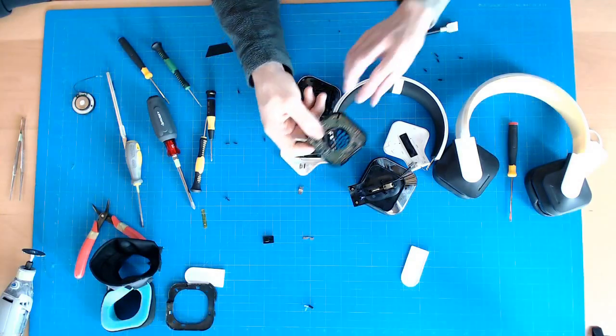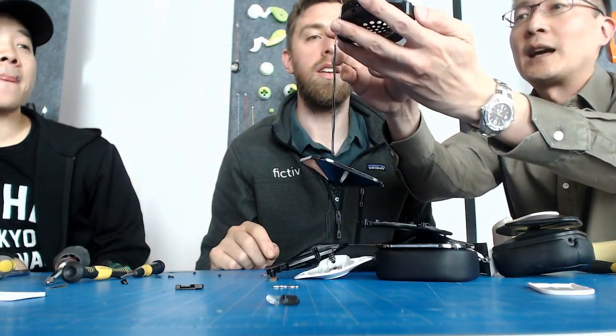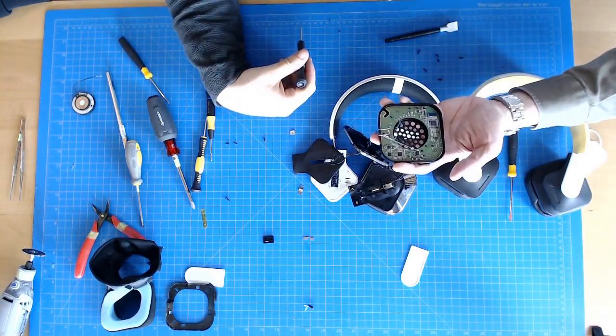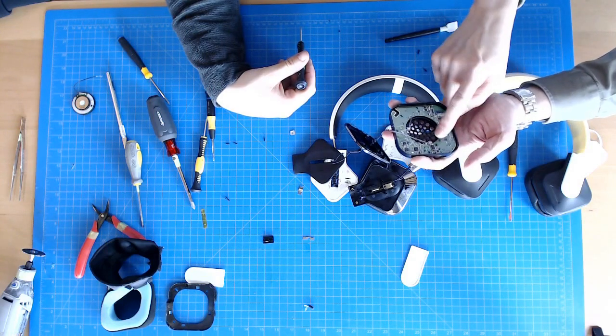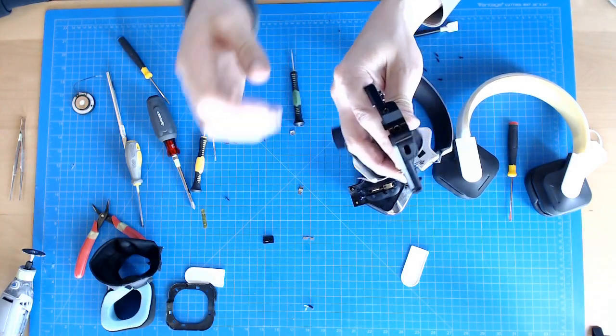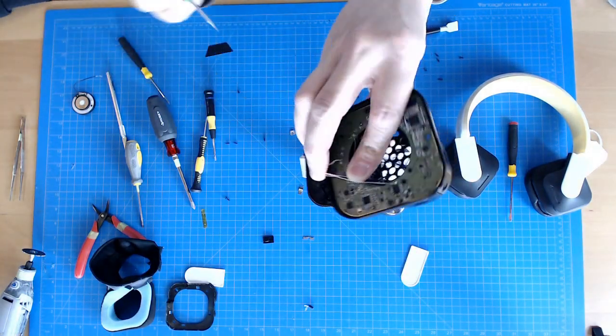Yeah, I'm glad you asked. It's one of those things that we are a stickler about because we work with the manufacturers so much that you often see, and those of you out there who've worked with a lot of suppliers before, usually they will put 4 screws in it and make them a little bit sloppy and it's going to be floating all over the place. We always insist on having alignment features. So on this product, I don't know if you can see that. You can do the top down, yeah. You can actually see pin and slot here, so it's aligned, centered. And the end closest to the connectors is where it's very tightly controlled. So it's as close as you can get to perfect alignment between the opening and where the connector is.